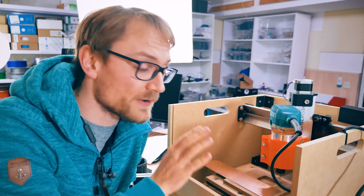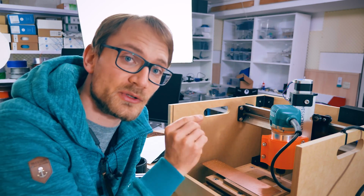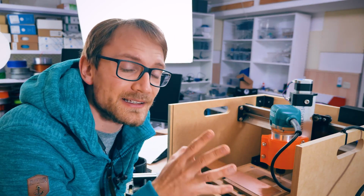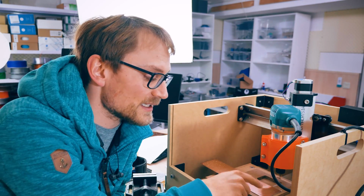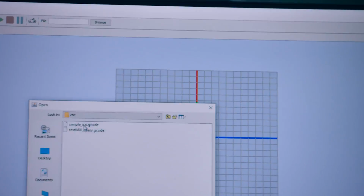I made a quick new revision of this board that cuts out those traces, which, because this is a single-sided board, is going to allow me to use wider traces that won't have to pass between solder pads, which, you know, is something that is tricky to mill out either way. So with a more simplified board, I can just use super wide traces and spacings. And with that new layout, I don't think, even with these shortcomings, that's going to be a problem.